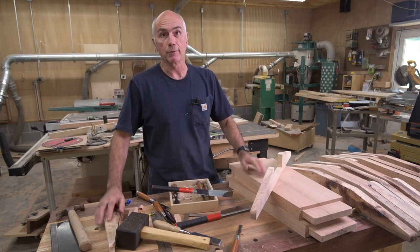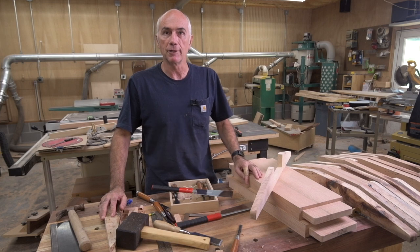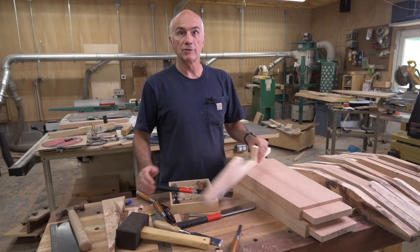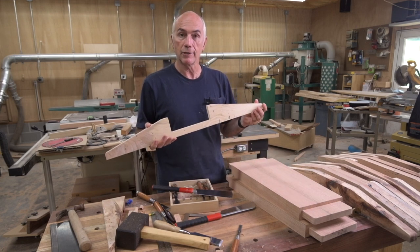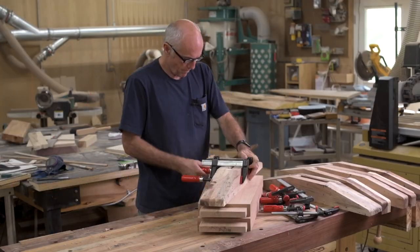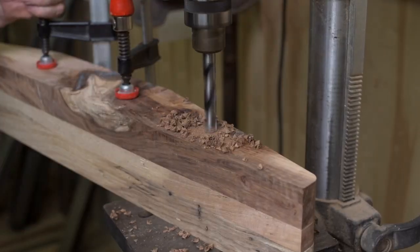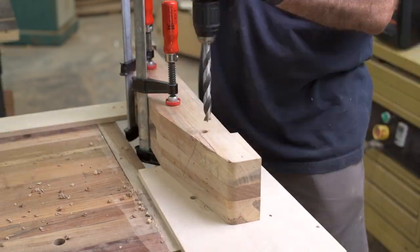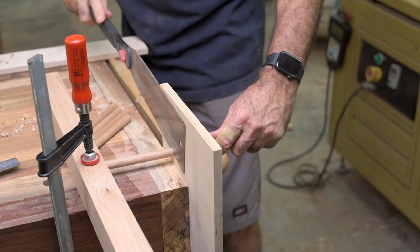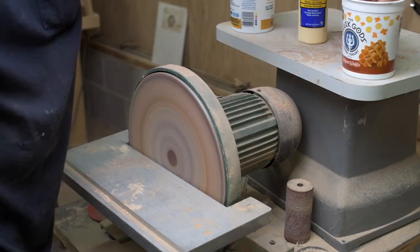That went pretty well. I had just about all my hand tools out there to see what would work for me, but by the end of it I'm only using a few tools, and there's a big difference between the first one I did and the last one. It was very handy to have the mortise pieces available, so I'm glad I didn't glue them up. But I think we're at that point where we're ready to glue up those parts. To keep the parts from sliding around once I apply the glue, I'm going to put a dowel right through them before I clamp them. I made a bunch of pegs the right length and put a little point on them with my disc sander.